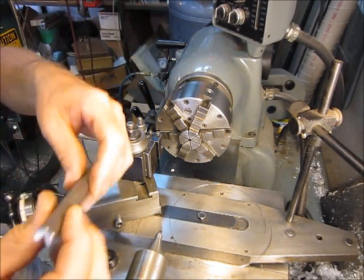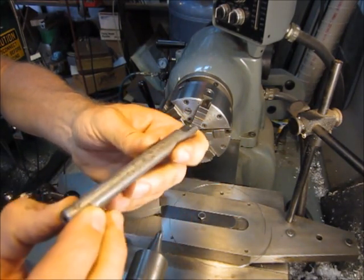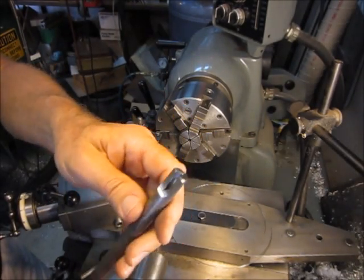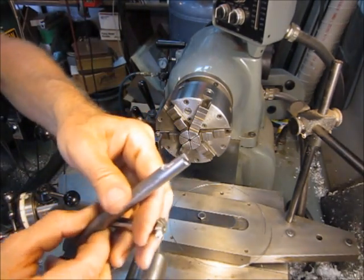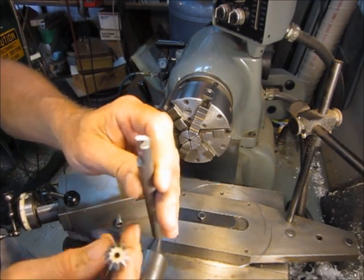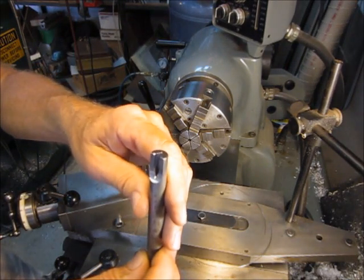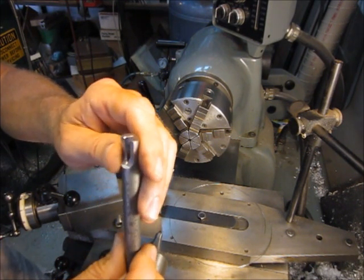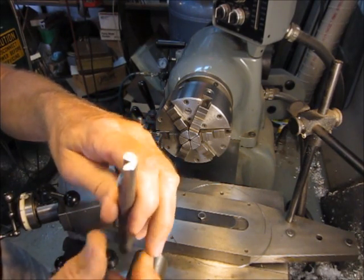Another important tool — the most important tool — is a wire guide. This one in particular is a half-inch piece of cold rolled steel. I've drilled a 3/16th hole pretty much the full length of it, down to within about a quarter inch of the end. I went back with an end mill and cut away some of the bar down to about the side of the hole, then went in with a 60-degree cutter and cut a V in it to act as a wire guide for different sizes of wire. This particular guide will work from the finest wire you want up to about an eighth inch. I've wound 80-thousandths wire and that's a handful — wire that stiff doesn't want to wind around a little tiny mandrel. It takes a lot of force, but this will do it.